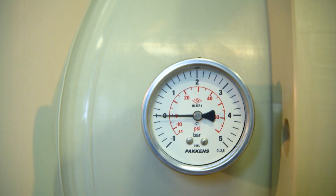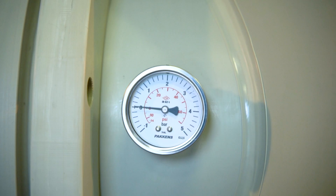On each unit we have inlet and outlet flanges which can come in imperial size or metric size depending on the request, and also we have pressure gauges showing the inlet and outlet pressure. From the differential pressure we can understand if our basket inside is dirty or not.